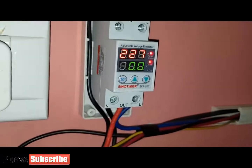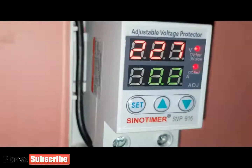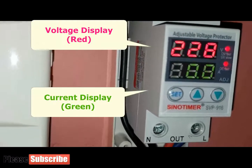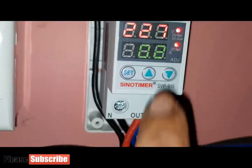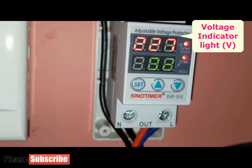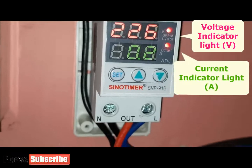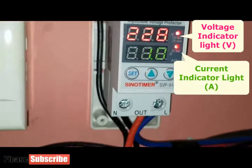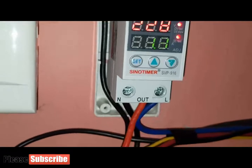Now we will see how this device looks while working after installation. You can see the following on the front panel: a voltage and current display, which works as a voltmeter and ammeter. The voltage indicator light flashes quickly in case of over voltage, slowly in case of under voltage, and is constantly ON in case of normal voltage. The current indicator light flashes in case of over current and is constantly ON when current is normal.